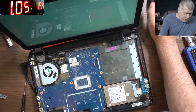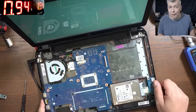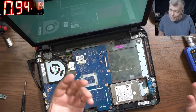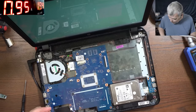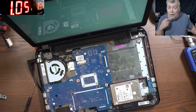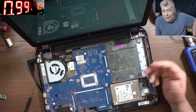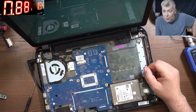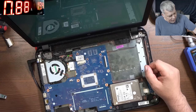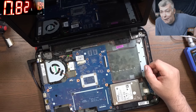But yeah, I screwed up. I just went blind and first went and asked the shop I worked at before, okay, give me a screen, because I believed it was a screen fault. Then after that, I ordered a new motherboard. And it proved to be that the ribbon cable was shorted at one pin, you remember? I suppose I'm just a bad YouTuber. That's what I am.